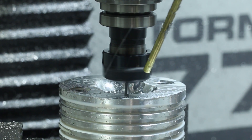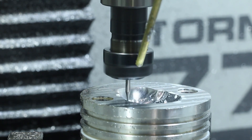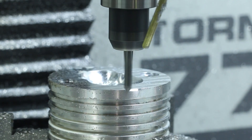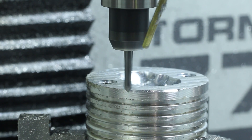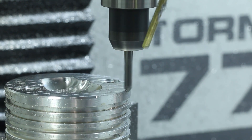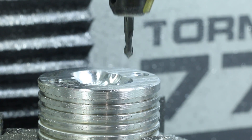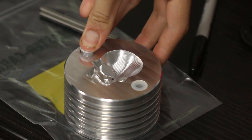I was really happy with the surface finish — I thought this thing turned out great. The tooling was great, we had adjusted the runout, the coolant is helping evacuate chips so you're not recutting those chips or wedging any cut chips between your cutting flute and the part and marring that finish. Just really fun — reminds me why I love machining, the ability to make something pretty cool, and it could be a really fun gift.